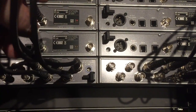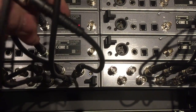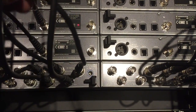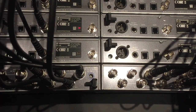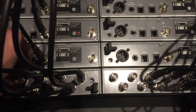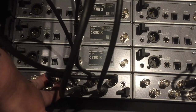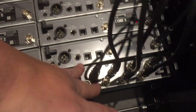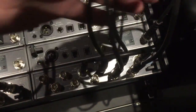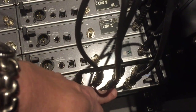By connecting the RF out A, we're going to stick that into antenna B — where, if it was a four-way system, the B antenna would go — and that's on the top here as well. So now this is giving the B side to all the units connected to it and it's giving the A side. The reason I've had to do it this way is to remind you that the power only comes out of A — A1, A2, A3 and A4 — on both units.